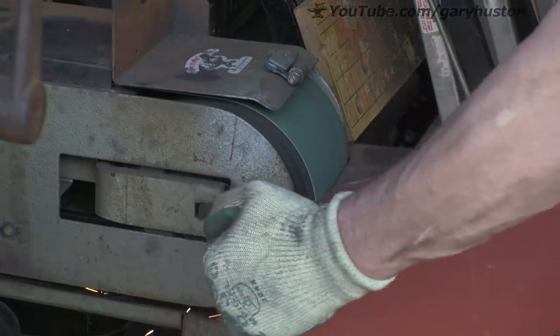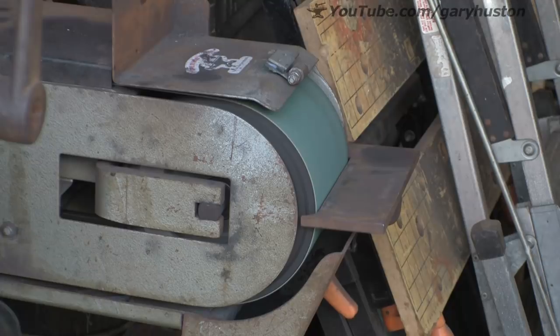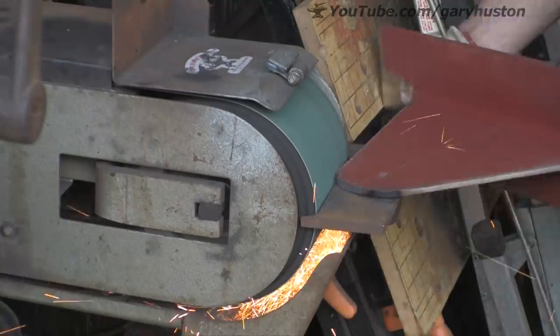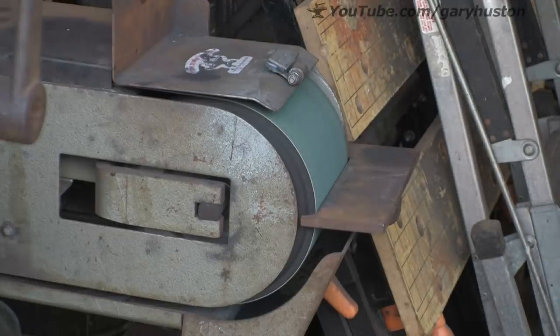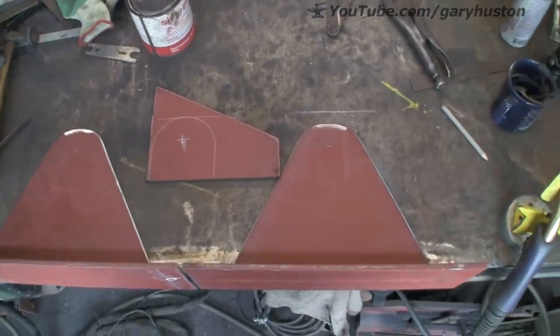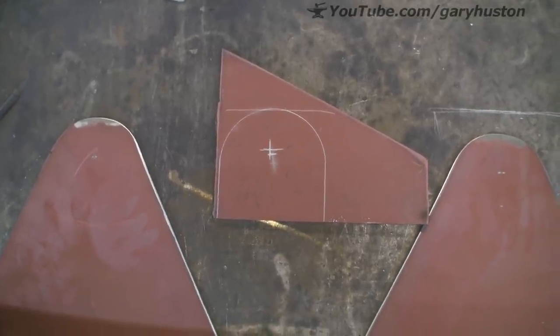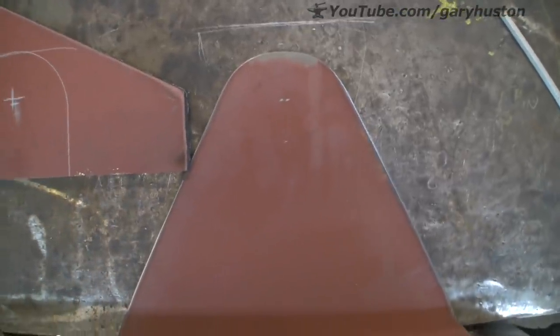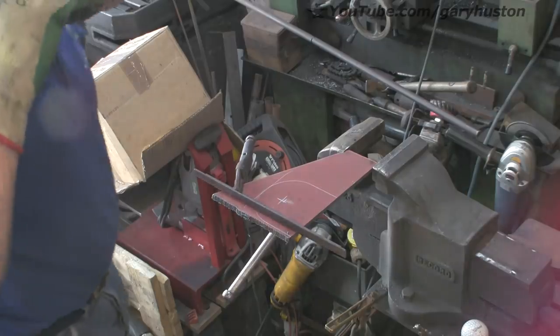Just check the line — that's the side with the line on it. There you go. Let's just do the other one. Done. So next job — I've centre-dotted where I want the holes and I've marked out on that bit of scrap the piece I'm going to use to go onto the actual plate that the gearbox is mounted on. There are the centre dots and I shall cut this one out and then use it as a pattern to cut the second one.